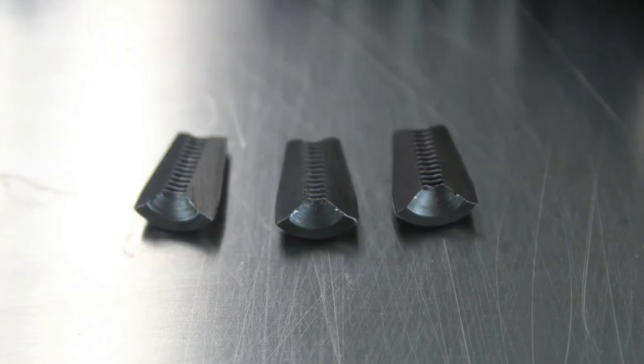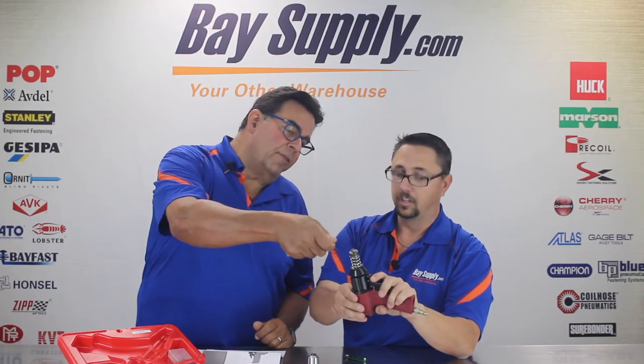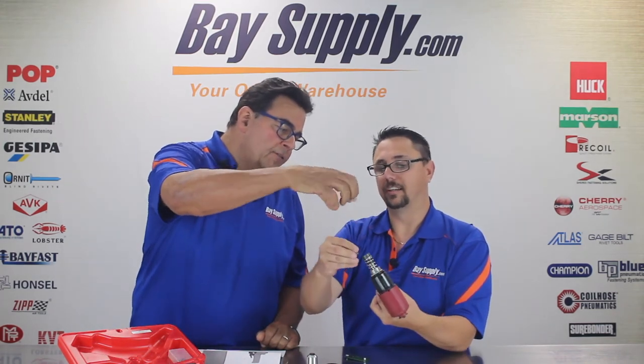You'll notice there are no wrench flats — we're not tightening this up with a wrench or scratching it up with a vise grip. We're just going to twist off the front nose assembly and see the jaws inside — nice three-piece jaws. You want to keep these clean and lubricated with some jaw lube. You can take an air gun and blow the filings out as they build up; check and change these regularly. To reinstall, put the jaws back in with the large size first — you'll notice they mate together with little angles on the shoulders. Once set, reapply the air and give the pull trigger a pop so the jaws seat into place, then reapply the front nose assembly and you're ready to go.